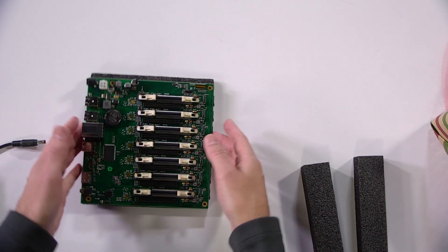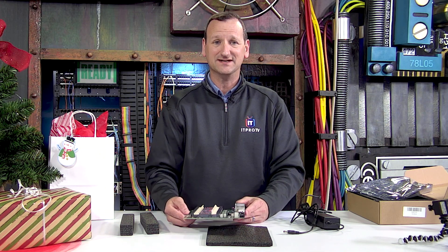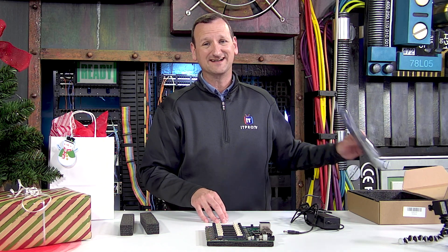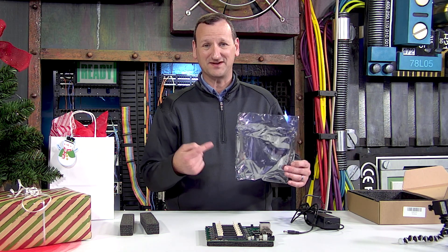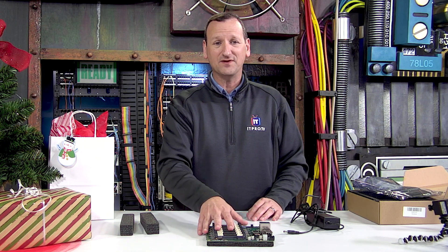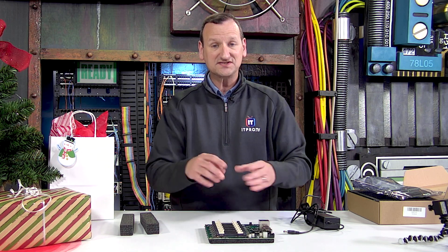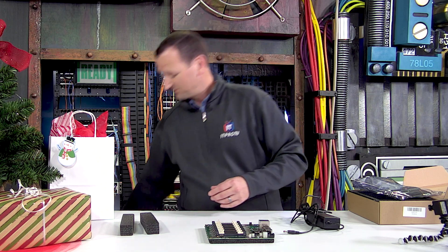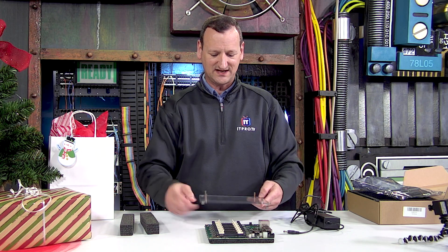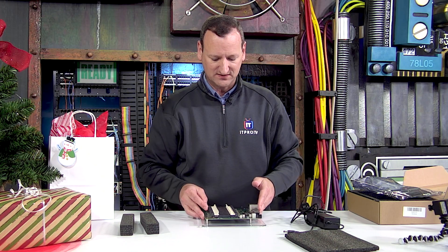I am currently resting this board on top of the styrofoam it came with — that's probably not a good idea. Some styrofoam, depending on how it's manufactured, can actually be conductive. I've seen videos where people put them on top of the static bag and don't realize that static bags are actually conductive too. So if we're going to operate this, we really need to stand it off to protect it and make sure we don't ground anything out. Now, it is a standard ATX form factor, which is really cool. Maybe you've got an ATX case laying around, or I have this little plexiglass thing with offsets on it, so we can mount the board right to that.